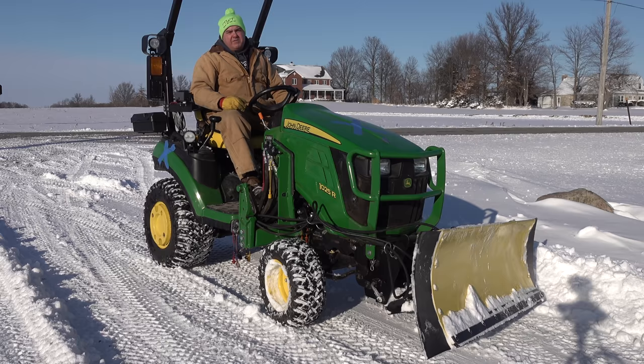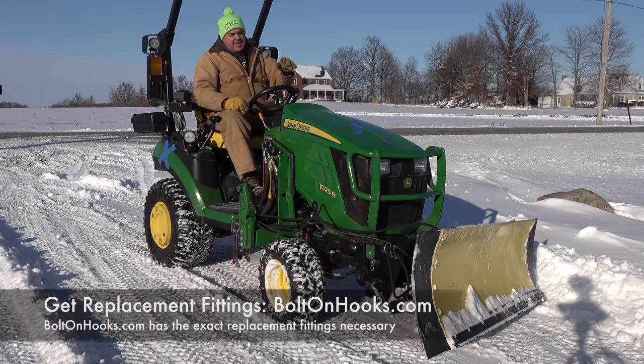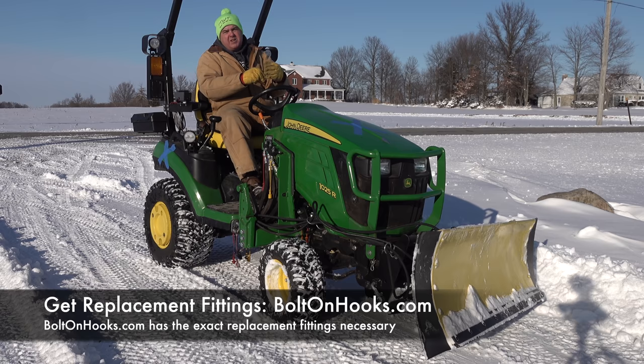There have been some people who abuse these a little bit and can bend that quick hitch system. That's one of the negatives. There's also a negative if you back drag with it too much, you can get ice built up in there and you can break off some fittings off of the cylinders fairly easily. Those are the two negatives I know about this particular solution.